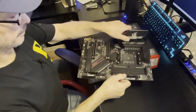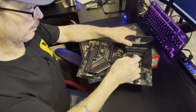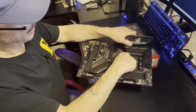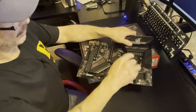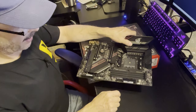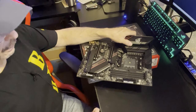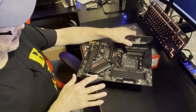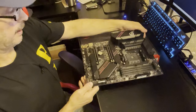To get back to the VRM - a lot of motherboard companies are now sharing phases. This one is technically 14+2 but they share using chokes that triple up so they can get those higher numbers. It's not really what I'd call true 14+2, but it basically makes the board act that way and gives you that performance.